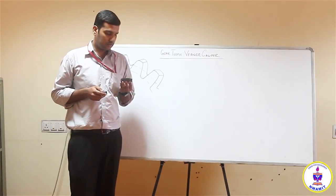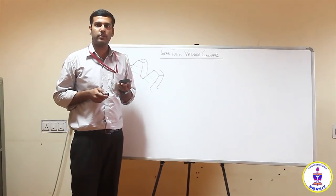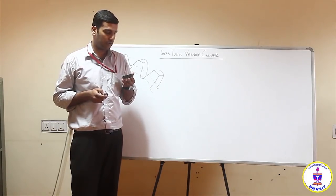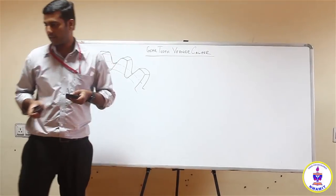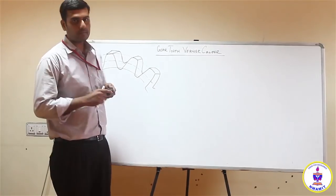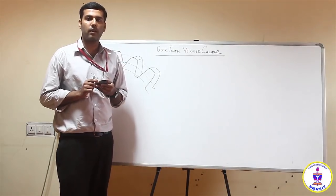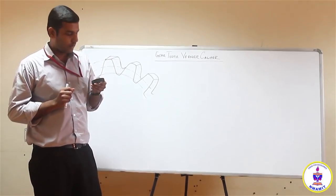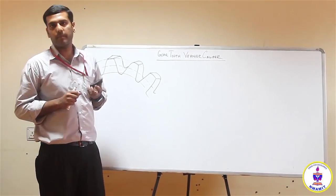Now here I am interested in finding the quality of this gear after it has been manufactured in either a milling machine or a hobbing machine, or by using any one of the different methods for manufacture of gears. Generally there are only two methods very commonly used. One is casting and imprinting the gear. The other is simply using a milling machine where a hob goes round and round, cutting the gear to the given length and thickness of the pitch circle diameter.